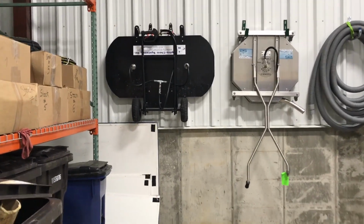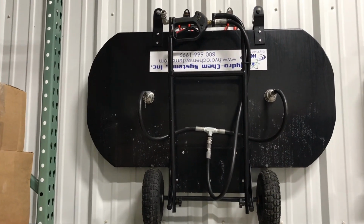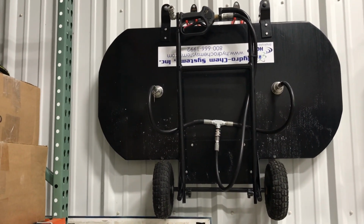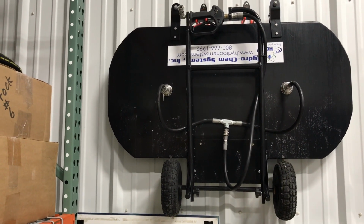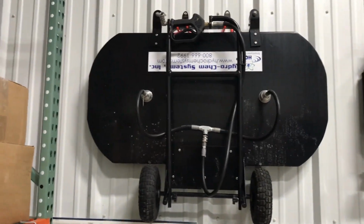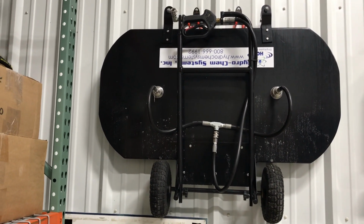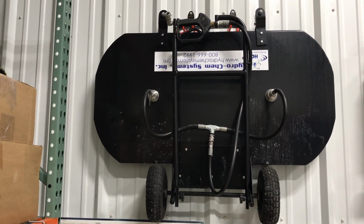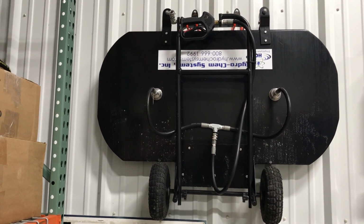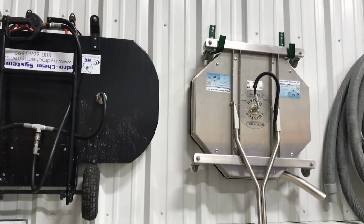Then we have this 48-inch, which is huge. This will clean a full 48-inch wide sidewalk. It's actually 49.5 inches. Got heavy-duty stainless steel swivel and bearing assembly. Big believer in that. I'm not a believer in aluminum when high-pressure water is going through there. They work okay when it's hydraulic fluid, it's lubricated, but it erodes very, very quickly. Not good to have different materials in there.